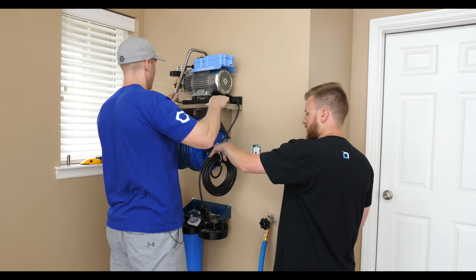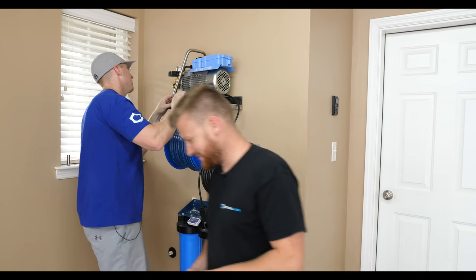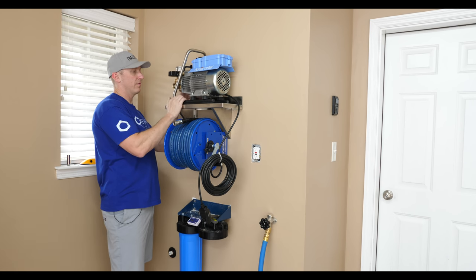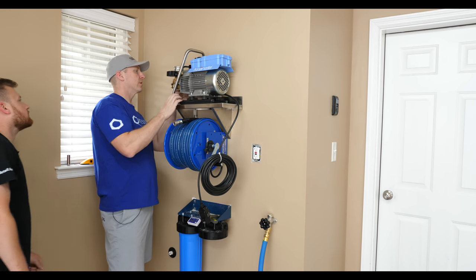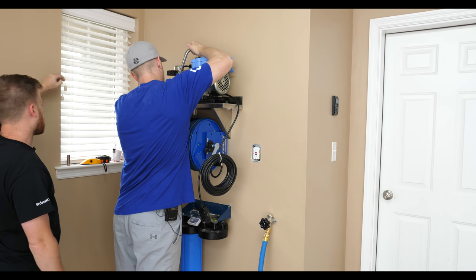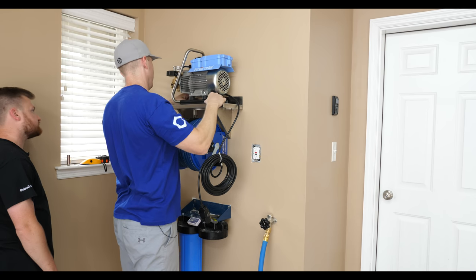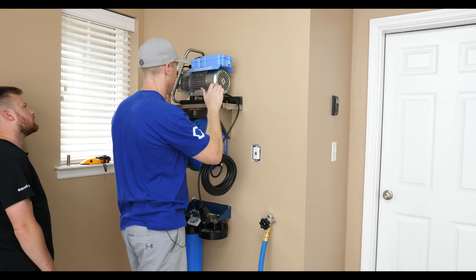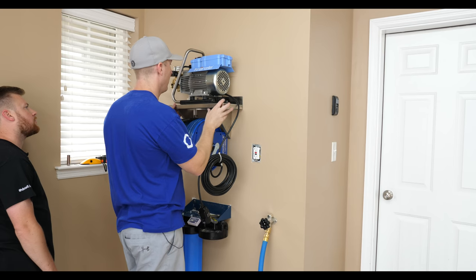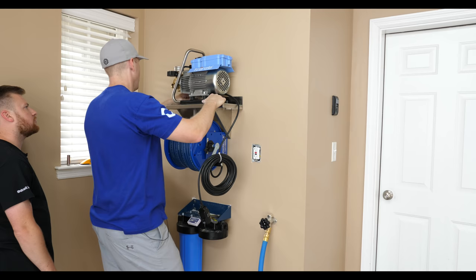Tell you what, though, I don't think this power cord is long enough. I don't think we're going to be able to make it to the outlet. A couple of notes here. One, we've got an unloader valve, right? So that's the red knob on the side. And the unloader valve, you can't butt it up against the wall because it kicks out when it turns on, right? So we want to make sure our shelf's up against the wall. We'll worry about it. It's going to shift and move as we're messing around here. But we'll center it all when we're...